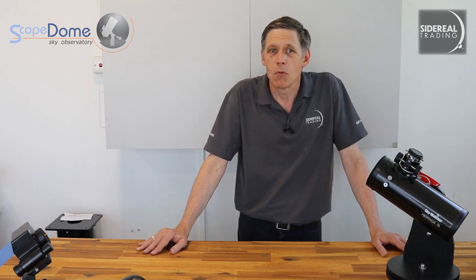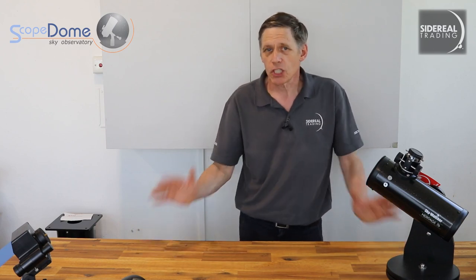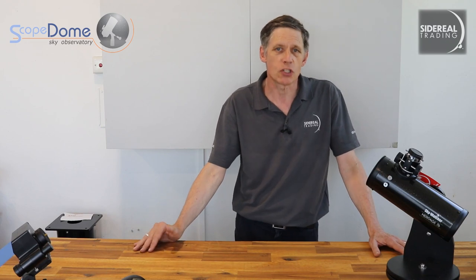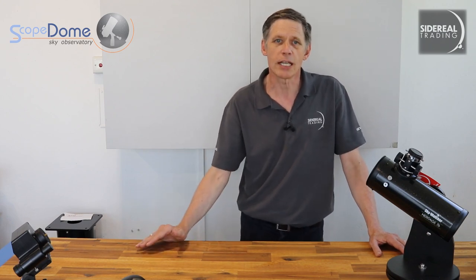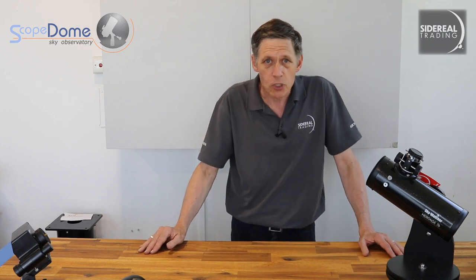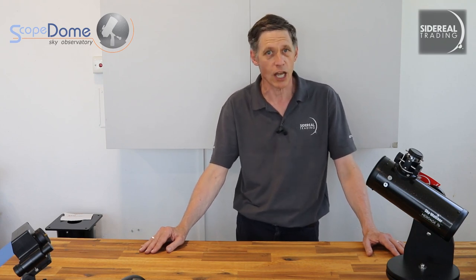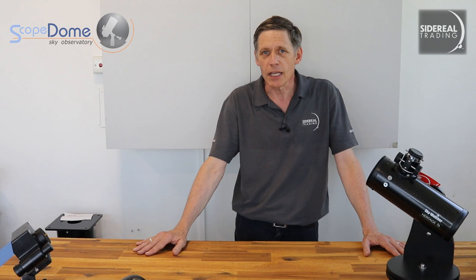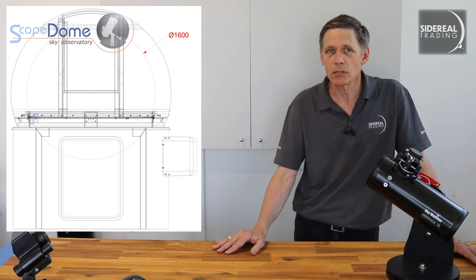Back in the shop. The shutter width is 59cm, so obviously this is the largest aperture you're going to get into the dome. Given information on offsets and other geometry, the software you're using to run the dome will be able to place the centreline of the shutter directly in front of your scope, so you can get some seriously large aperture machines in here — something like a 14-inch SCT would be no trouble at all. The usable space inside the dome is less than 2 meters, because that's the outside diameter. Structural parts inside make the usable inside diameter a bit less, and the rotation motor is quite large and can get in the way. Officially, the largest sphere you can fit in here is 1.6 meters in diameter, but your scope probably won't be balanced in the middle, so you won't be able to use all of that.